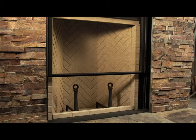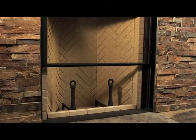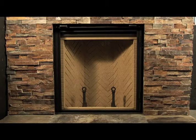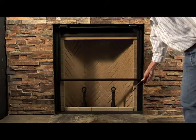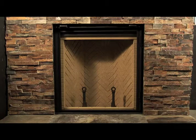The door of the Renaissance is engineered to last a lifetime. We've used premium ceramic glass to ensure it will stand up to any temperature. The ceramic gives a neutral brown tint to the objects behind it, while traditional tempered glass generates a green or blue tint. Another benefit of ceramic glass is that it causes virtually no glare from any angle. The door's guillotine mechanism is perfectly counterweighted so that it stops at any point in its travel. It will never slam up or down despite its heavy weight, and it can be opened or closed with a single finger.